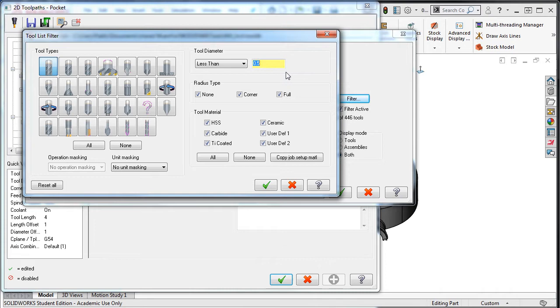And now I can see that the arc is ½ inch in diameter. I want to use a tool whose diameter is less than this so that the tool has to feed through the corners and not dwell like it would if the same size tool were used, as this can cause chatter.